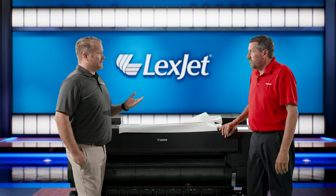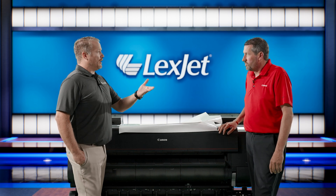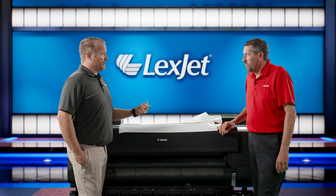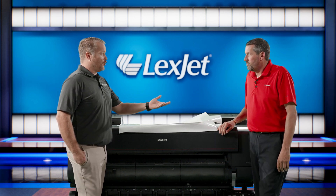If you print to paper that's a hundred degrees from the back of a delivery truck one day, and the next day you print to it acclimated to 73 degrees in your shop, it's probably going to look very different. A lot of it is a humidity factor. People think it's the printer, but the printer has a very broad humidity range in its specifications. Media, depending on the type, has very small ranges, and every media has a spec sheet telling you what levels to maintain — that will impact your color and how the paper acts through the printer.